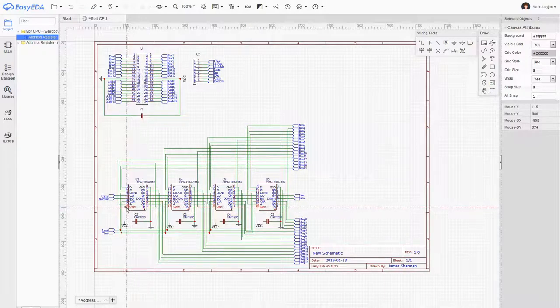Okay, things are starting to get pretty tight in here now. So I'm pleased these are the last wires I've got to add to this particular section. Okay, I don't like that. Okay, so these are your basic power decoupling capacitors, designed to keep the high frequency switching off the power rail. And this is a larger capacitor that I'm putting across the main power inputs, which just isolates the power here from any other modules. Okay, so next up we need the bus assert pairs.